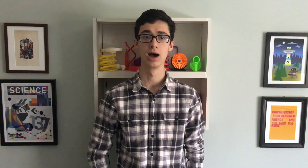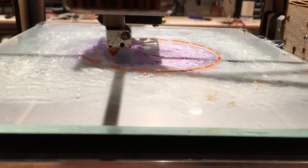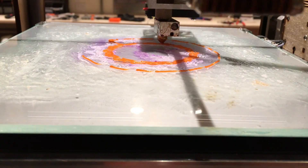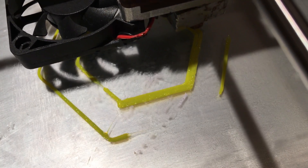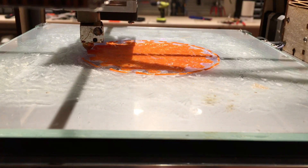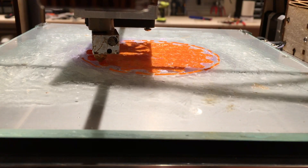I found the most difficult part to be printing the first layer. I leveled my printer with something an eighth of an inch thick and adjusted the leveling while printing, so that a significantly thinner, squished-down line of plastic is extruded. For reasons I'm not really sure of, bubbles form in the extruded plastic on the first layer, causing gaps in lines. After the first layer, though, this problem disappears entirely. Let me know if anyone has any thoughts on this.